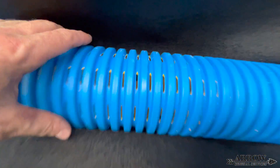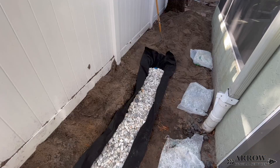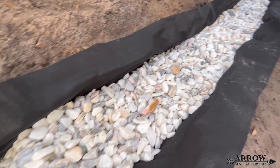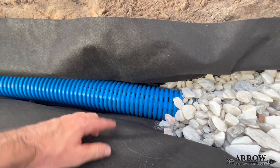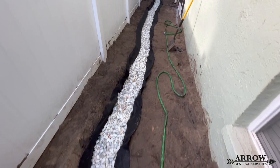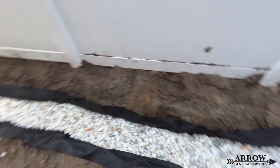The pipe we will be using at the bottom of our trench is the French Drain Man high octane slotted pipe. These slots allow a lot more water to pass freely through the system, as well as silt and sediment. You want to keep your pipe at the bottom of the trench to evacuate as much water as quickly as possible — if you put stone at the bottom first, water will always sit there and tree roots will be more likely to enter your system. We are using three quarter to one inch stone, which creates good size voids; the bigger the stone, the bigger the void, and the more water you will be moving.